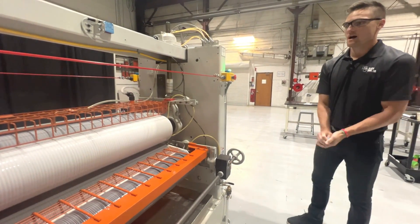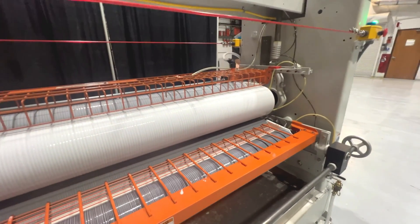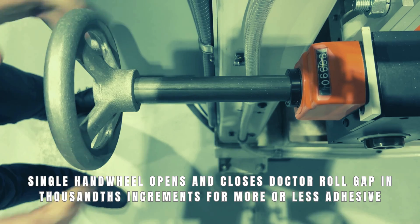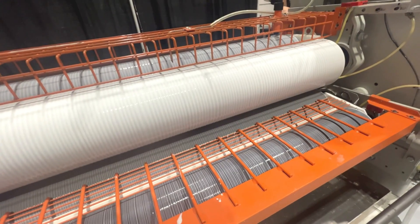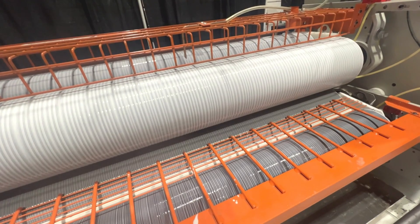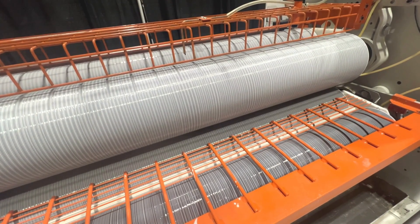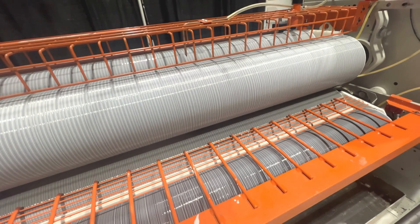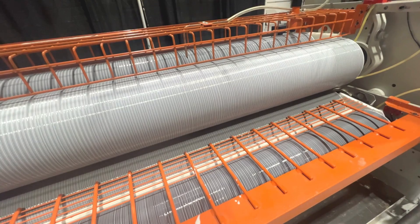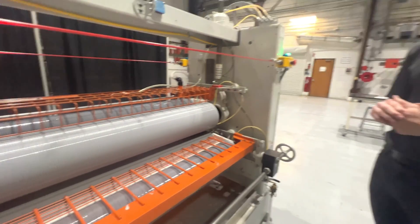To get this corrected, visually look at this roll — I'm going to push my doctor roll back into place. What you want to see from a visual standpoint is that groove pattern. Anything over that groove pattern is adhesive you can't control anymore, so let that groove pattern do the work for you. And if that groove pattern is not doing the work for you, it sounds like you've got a worn grooved roll and you need to get it in for reconditioning.